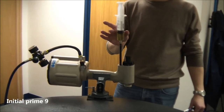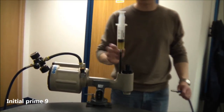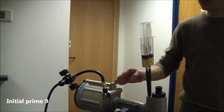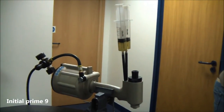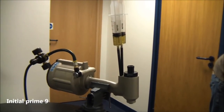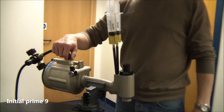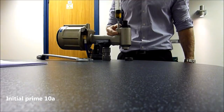With both volumes evened out — no more than 25ml of air or oil in either syringe — we'll connect the tool to the air supply. That will then make sure the air piston is in the top position. Then disconnect and remove the air supply. Remove one of the priming syringes from the return side and reseal with the screw and the dowty seal.